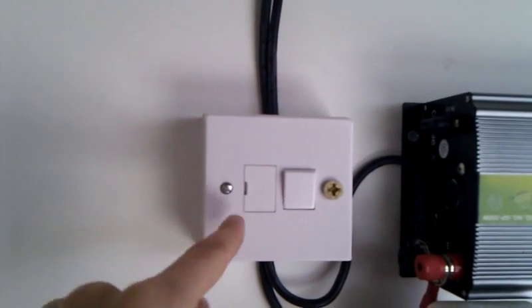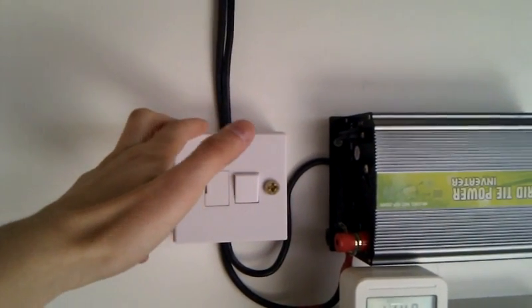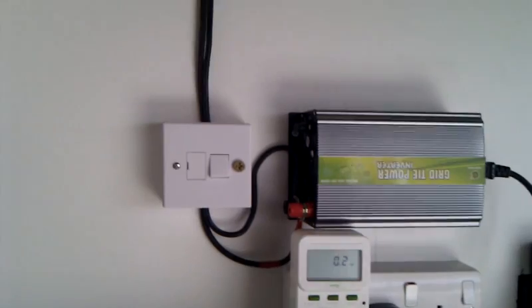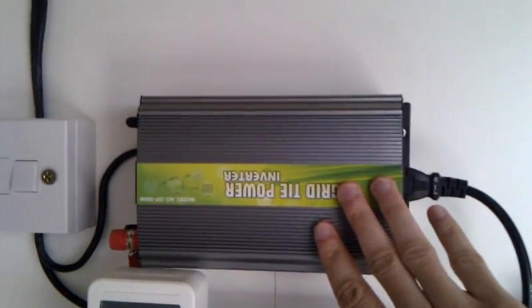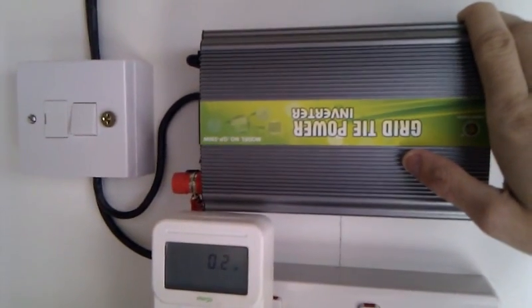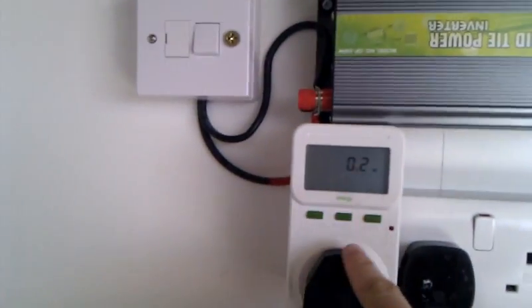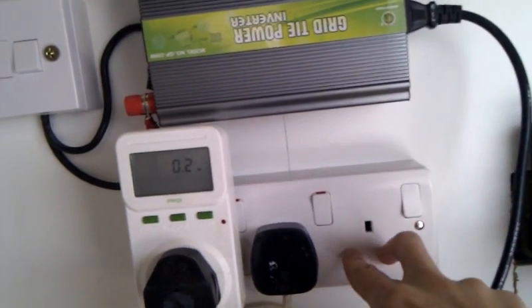I worked out 160 watts with the panel — really I want a 15 amp fuse, but it works out okay. With this I can flick it off for fault diagnosis. The grid tie inverter itself is off eBay for about £80, and it's rated 350 watts. It's got a little kettle lead coming through a little power meter. My dad — he's an electrician — wired this in. It's a standard mains plug that goes behind all this panelling, straight into the fuse box, and then straight into the house. So anything those two big panels make goes straight into the house.